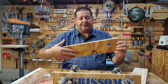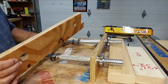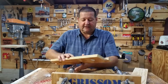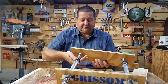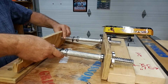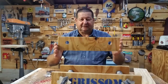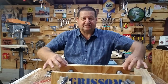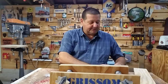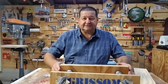The next thing is to put on the back jaw, which has the notch in it. I'm going to use those notches to secure it to the work table. The reason I call this modular is you can change these jaws out to whatever size or dimensions you want. Then I'll put the front jaw on — this is what actually forms the vise. Put the spin collars on both sides, and we're in business. It's that easy.